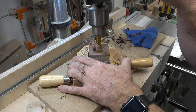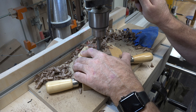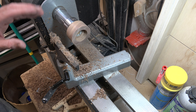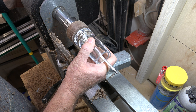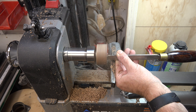With a drill bit this size, do not try to hold the blank by hand — clamp it securely in a hand-screw clamp for a much safer operation. Then right in the center of the Forstner hole I drill a one-inch through-hole, which is for a collet so we can mount the piece to the lathe. With the blank mounted up, I just turn it to round. With the piece rough-turned, I insert the ceramic grinding mechanism into the hole — it's just a little too tight, so I enlarge it ever so slightly for a better fit.